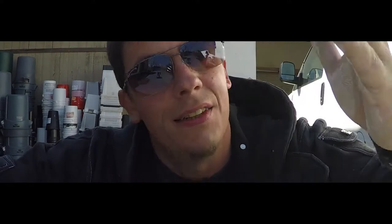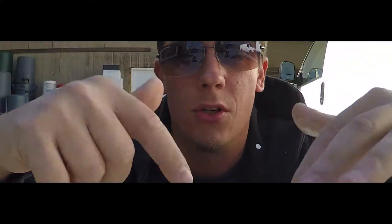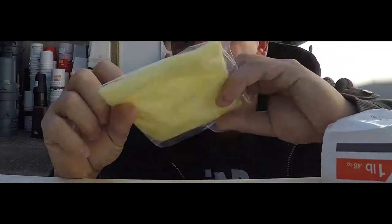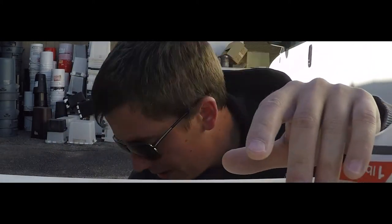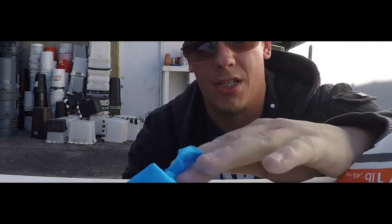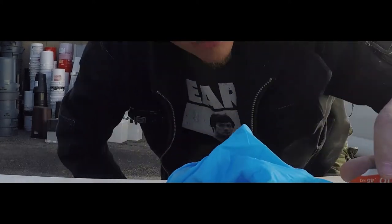When you have this much dust on there you will mess up your stain. What you want to do is wipe it up with some towels first, then use this other type of sticky tack cloth that they sell at Home Depot. You also want to wear some gloves because that stuff is pretty sticky and you're gonna be staining anyway. Alright, let's work.